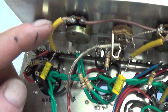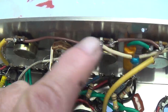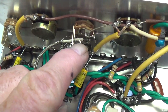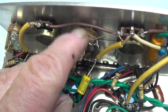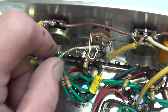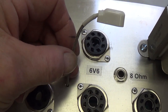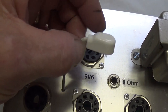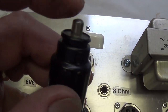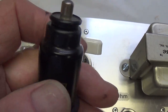I used shielded leads for each of the tone pot and the two volume controls. A rather unique lead is this one from the input leaf of the pentode input jack. You see a large, heavy shielded cable passing through the chassis. And it emerges here with a porcelain grid cap that's spring-loaded to lock on here to the cap at the top of our 6J7 pentode tube.